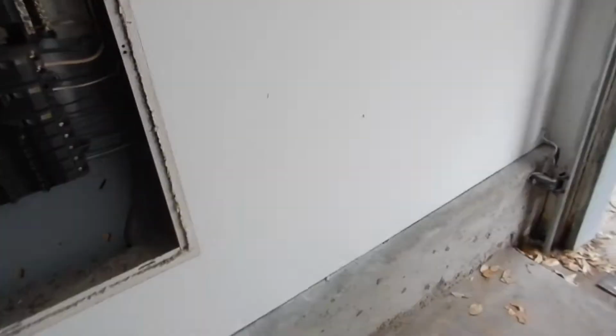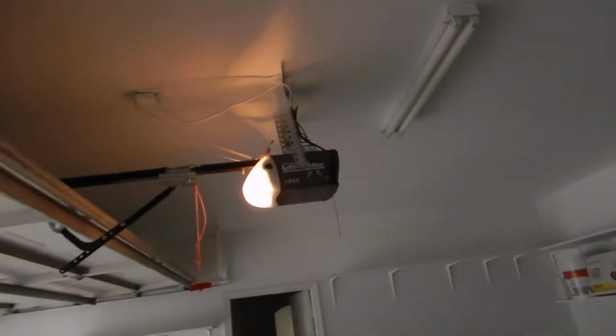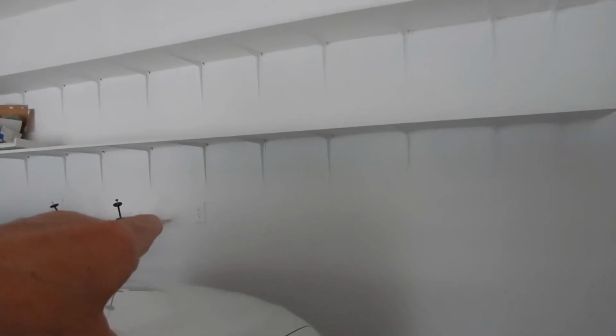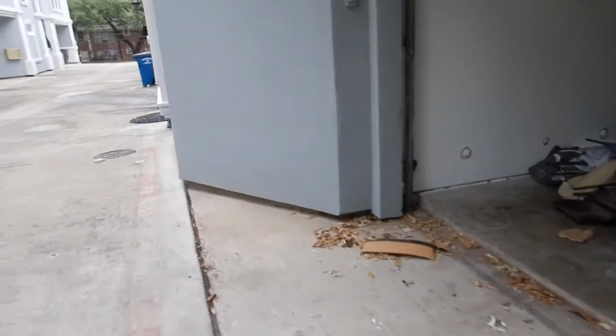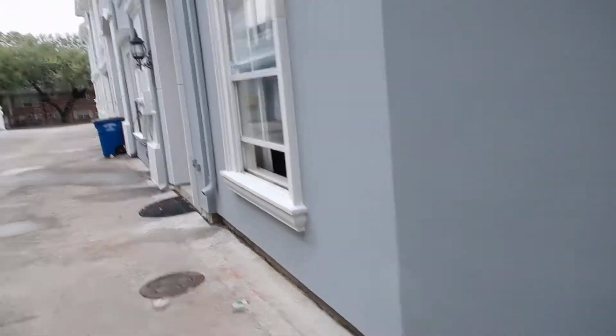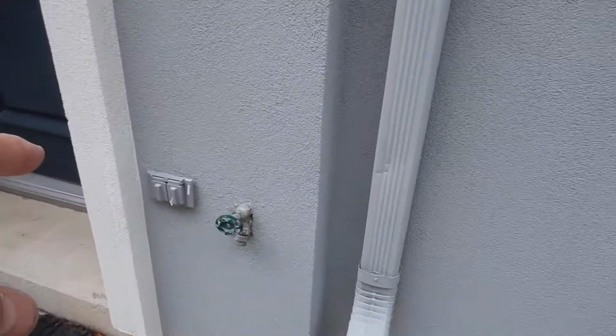So this is inside the north wall. This is the electric service panel. Okay. And also in the electrical in the garage, that is GFCI. It does not protect the overhead door. It does work on this receptacle outlet in the garage, just not the ceiling. It works on this receptacle outlet that does not have an in-use cover.